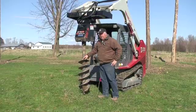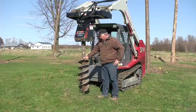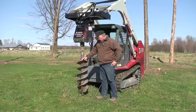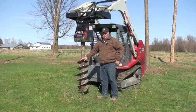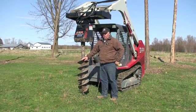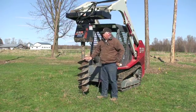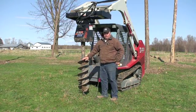This is what we're using for our auger for setting our pole holes. It's a commercial-grade hydraulic auger, 12-inch, and it's really necessary if you're putting in these large poles, because sometimes you hit stone and you've got to get down at least four feet so the frost won't push them up. It seems to be working pretty good.